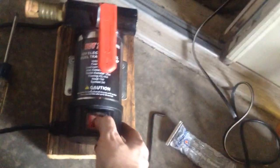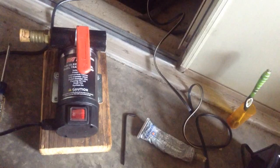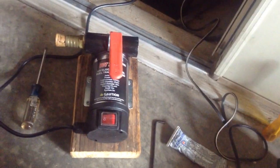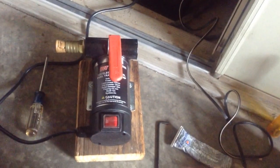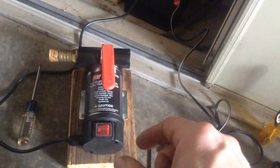The commutator had a little bit of scoring on it from that short amount of time I used it. While I had it apart I took that out and polished it up — made it shine where it was dark. The brushes are really small and probably super fragile in this thing, but it wasn't that hard if you've ever worked with electric motors before.